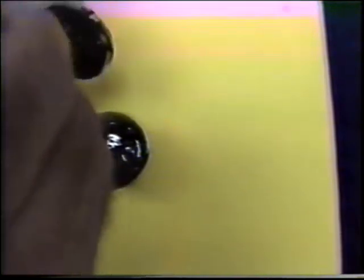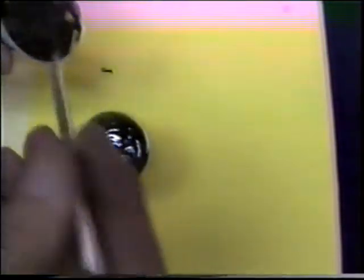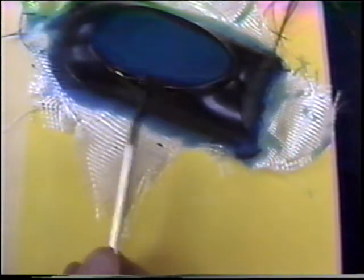And you mix up just a little paste till it gets what I call thixotropic. It doesn't drip right off the brush. And that becomes the material. Let me get this out of the way. That becomes the little material that you can use for, and I'm just blobbing this on right now. I'm not being real careful because it sands relatively easily. West Systems resin is, from my past experience, real easy to sand in and blend in.